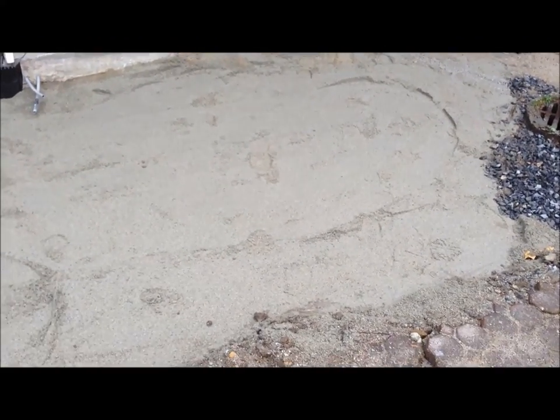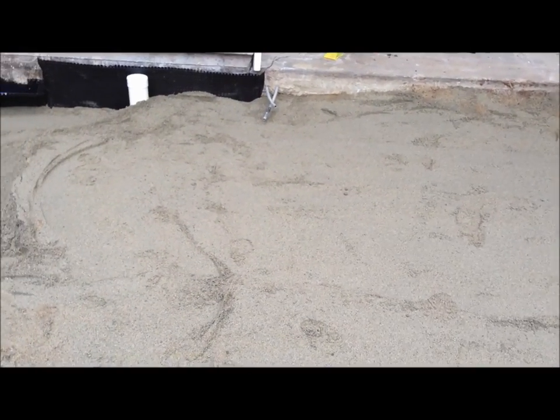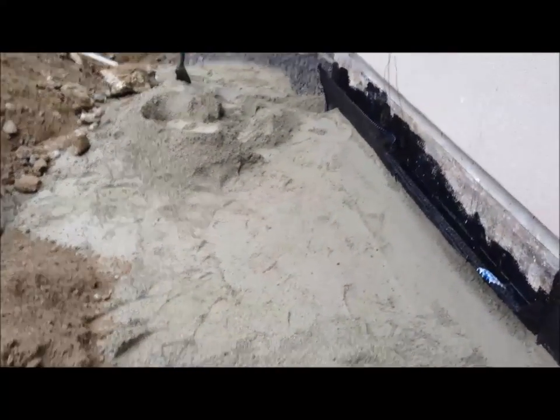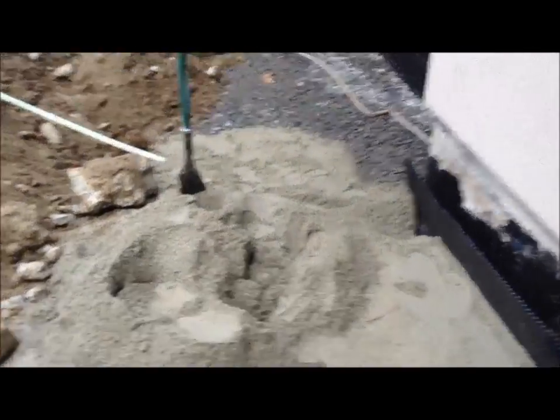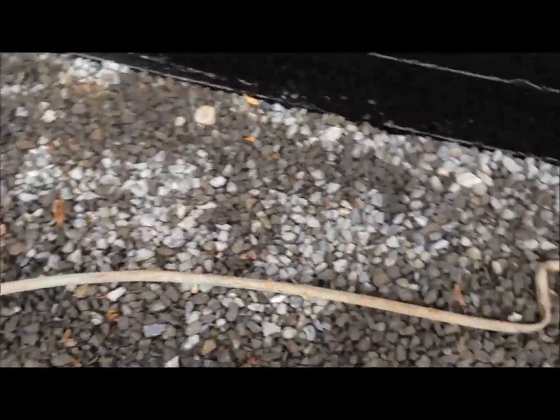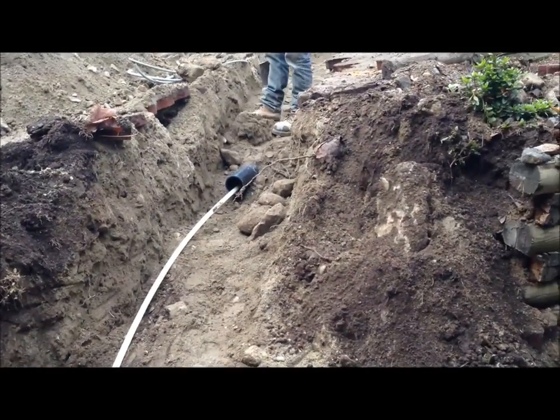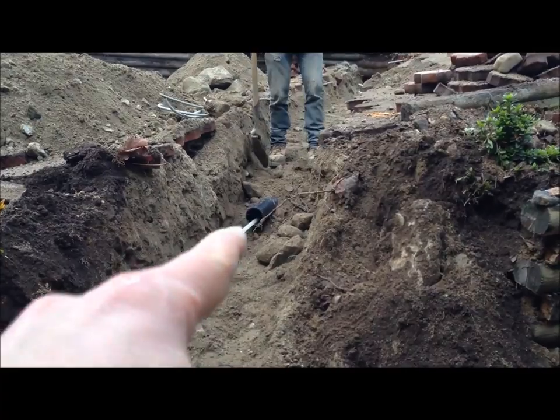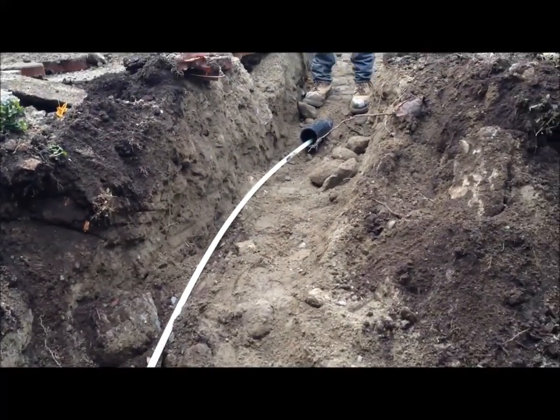So we're getting close to the end. Mike has brought in a couple loads of sand, so we're packing up the sand bed at the top. This is not near where we're going to do the pavers - this is just to get the sand in and compact it. He laid it in rough and then used that blue compactor to smooth this out. We've got a couple of layers here for now. What I want to show is the placement of the new main around the corner here. There's the old water main, which ran in that trench over to the public water supply.